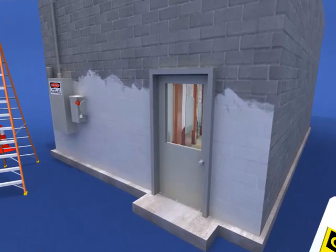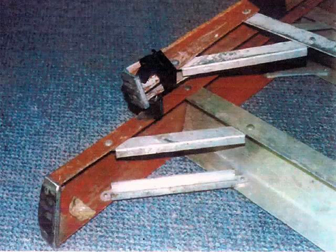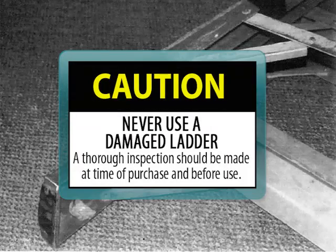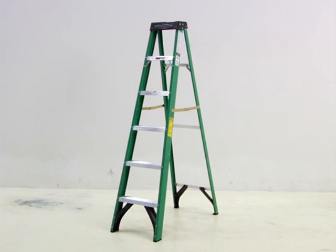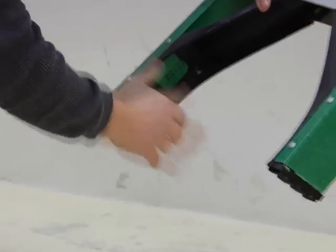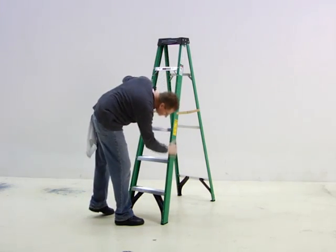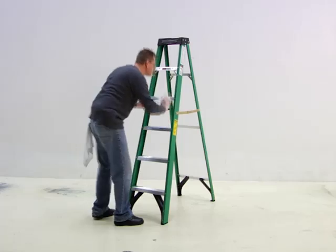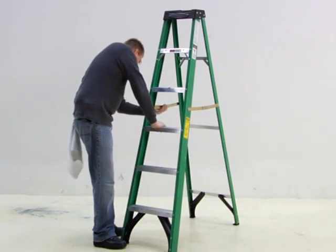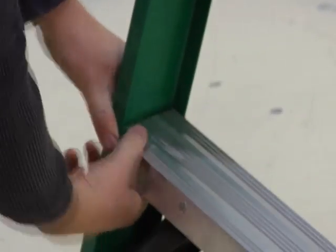Ladders must not be placed in front of closed doors — the door must be blocked open, locked, or guarded. Although highly durable, a ladder can become damaged by improper handling, transport, fire, or corrosion. A thorough inspection should be made at the time of purchase and before each use. Never use a damaged ladder. Examine the ladder for loose, damaged, or missing parts. Start at the bottom: make sure the shoes are present and secure. Moving up, inspect the side rails for dents, cracks, or bends, and check each step. Ensure step-to-rail connections are free from damage. Inspect all hardware and accessories — spreader braces must not be bent, and rivets, joints, nuts, and bolts must be tightly secured. All surfaces must be clean of oil, grease, and other slippery or sticky materials.